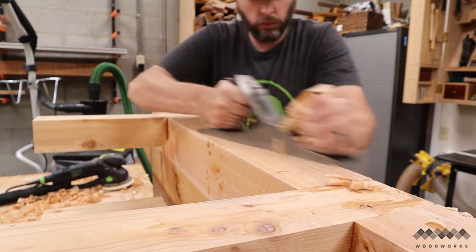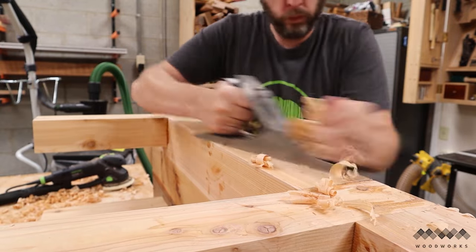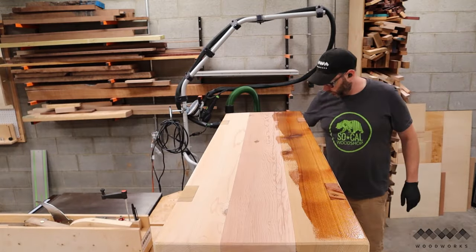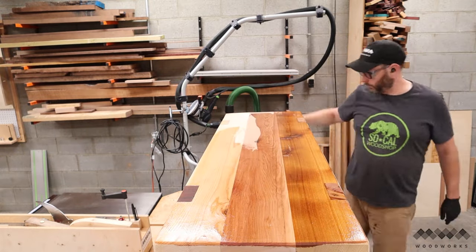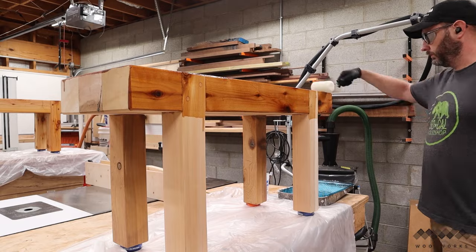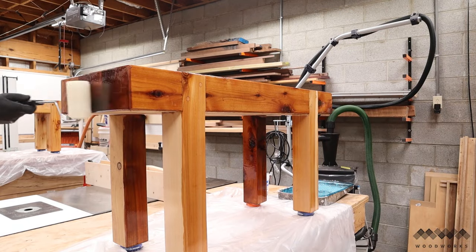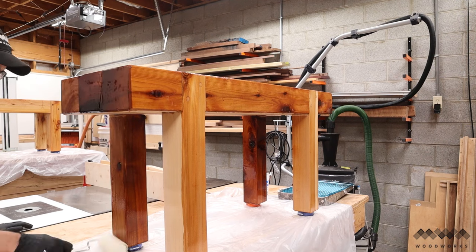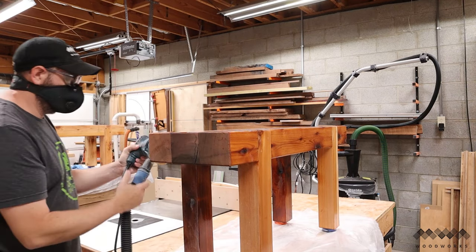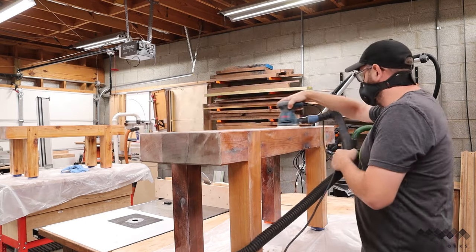I also remembered to chamfer the bottom of the feet to prevent chip out. I also broke out the hand plane on the other side of the bench to even up some spots where the legs weren't quite flush, before repeating sanding on that side. For the finishing process, I'm going to start by applying Total Boat's Epoxy Sealer. This stuff is very thin and almost like water, and I'm applying it with a roller. This cedar just drank the sealer up, which is perfect because it's going to help deepen the protection inside the wood. If it looked like the wood drank up all the sealer, I went back over those spots with some more. Once the sealer was cured, I sanded everything with 320 grit sandpaper just to knock down any dust nibs — you can tell when it's ready because it produces a fine dust when sanding and it's not gummy at all.